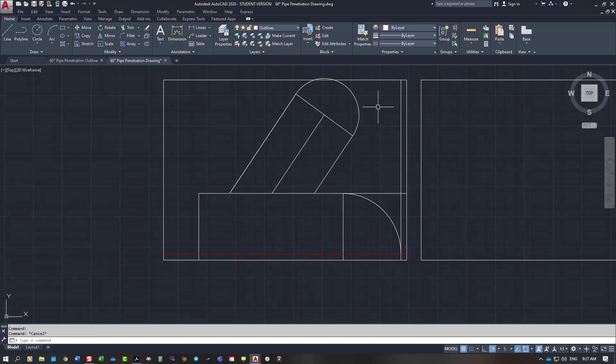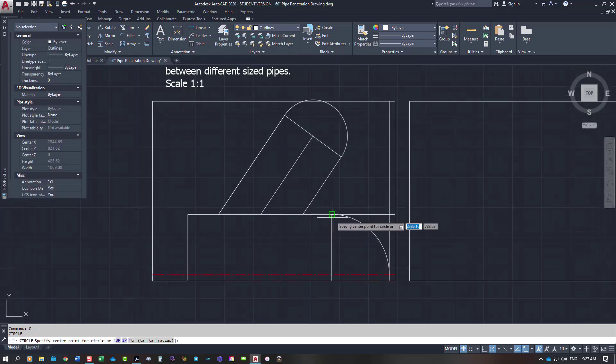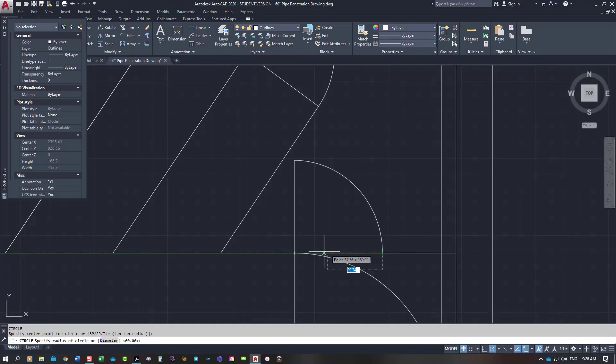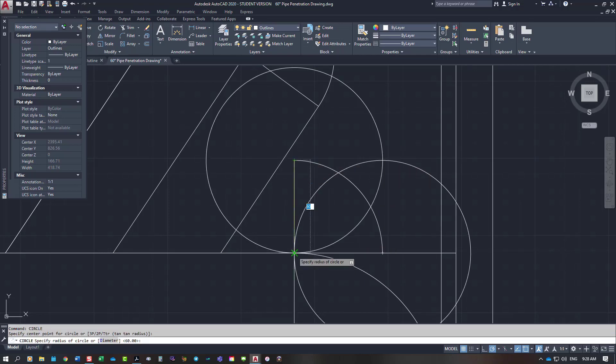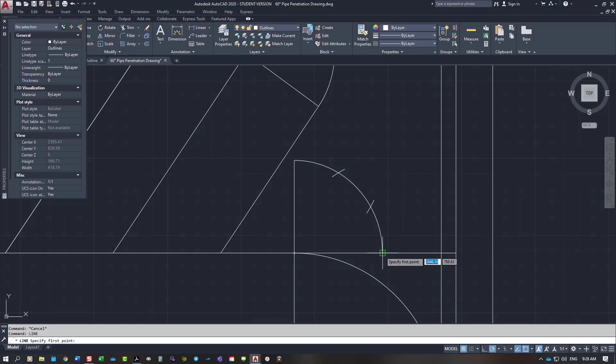Because this here is a radius of 60 millimeters, I need to draw a circle at that point at 60 mil and extend that line up. I'll trim everything out from that point to that point, getting rid of excess lines. Then we need to break this into three equal spaces — you'll just do this with your dividers. I find it easier to do it with circles on screen. I've broken this arc into three equal spaces.